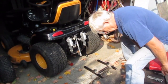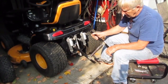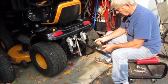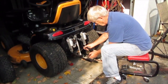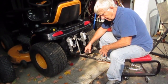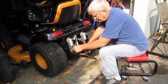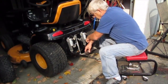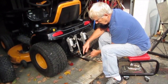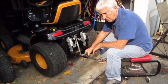Morning, a little bit nicer today. The sun's come out. I've decided to weld a brace across there after I've painted it. When it's on here with a plow on the back and side wood poles, it's going to pull these and break them off. I could have either put a brace from there to there, like they do on regular tractors, but for this application this is an easier way to do it. This makes this little framework rigid so it can't pull to the side.